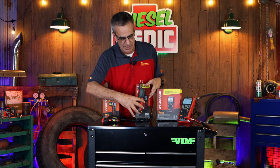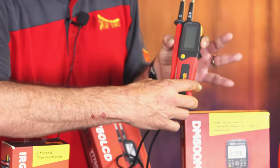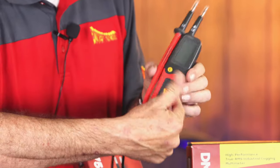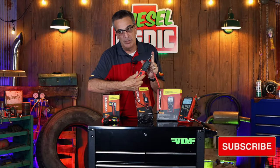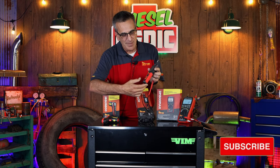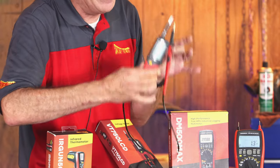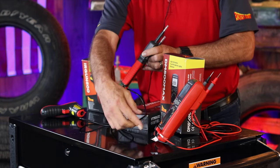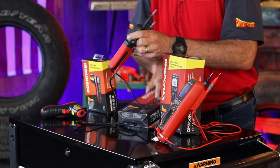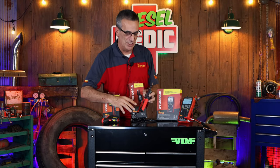That's where this comes in. Notice there are no leads to plug in, no settings to set — there's nothing to do here. As soon as I probe into it, it's going to give me a voltage reading. In fact if it's over a hundred volts, all I need is a single probe — it'll tell me high voltage, stay away. This thing could actually lose the battery; the battery could go dead and it will still indicate if there's voltage there. So if there's voltage there this thing will indicate it, and if it's not, this thing will verify it. And you don't have the chance of an error of having it in the wrong mode, the wrong leads, or anything like that. So it's the safest way to verify your high voltage disconnect.